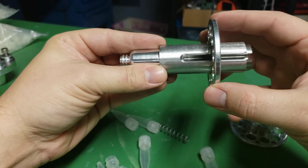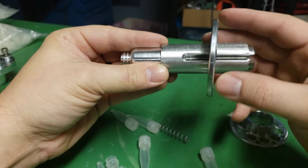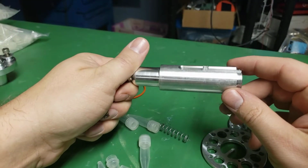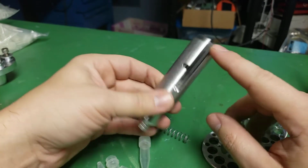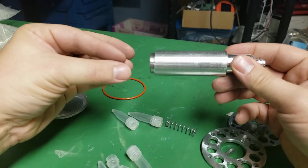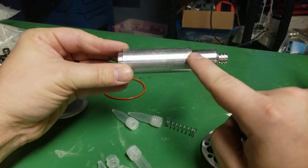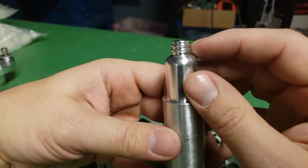And then if you bring it down and twist it, it'll push on that locking piece. So that's a good segue into this piece. Again, very similar part. I did this one on the CNC lathe initially, and then I came back and used the CNC mill for the secondary op. So I basically held my bar here and then used the lathe tool to profile all this and do these grooves at the end.